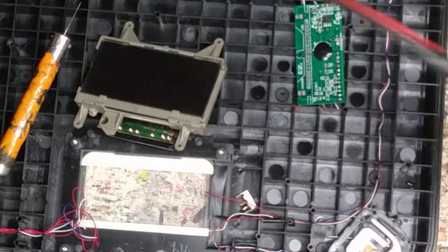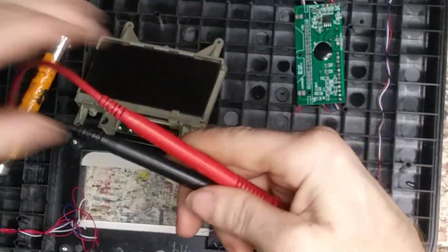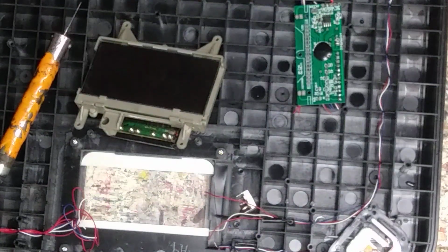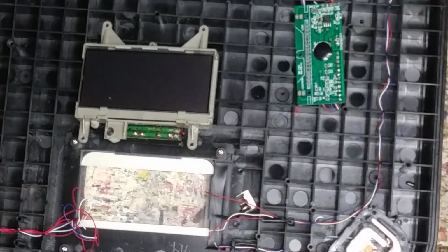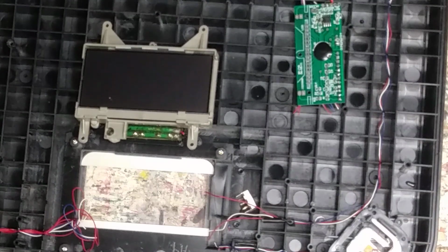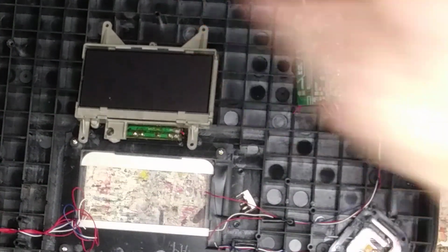And worst case scenario is, at some point, if you look back and you're like, oh man, how was that wired up? I can't remember offhand. If you got something like a plug that has 3 wires in it, if you go back and look, you can sometimes match up the spots onto the plug and tell what was your ground and your live, and then your common, and match them all up that way. It almost makes me shriek when people just cut stuff.